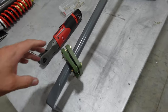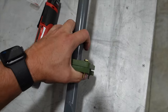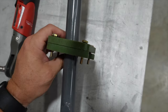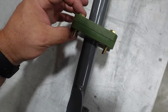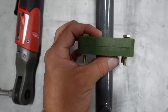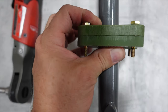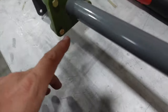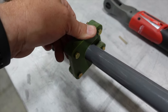This torque tube bushing has proven to be kind of a pain — I had to wind it up a little bit to take up the difference from the powder coat. Don't monkey around with the bolts; just get these holes a little bit bigger, otherwise you'll be fighting that the whole time. I widened these holes up just a tad so I can easily slide the bolts through, but as I sandwich that together it's not quite 90 degrees. I can kind of force it to 90 degrees but then it gets tighter, so we're going to play with that fit a little bit — may just have to take a little more off this side.